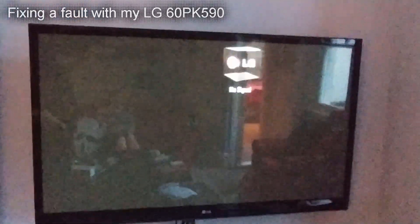I've got an LG TV and it's just rotating on this no signal. I've got a PlayStation 4, a PlayStation 3, and various other components attached to it. I did a big test last night, bypassing my amplifier, going straight into the TV, and it was still getting no joy in getting a picture. It is quite happy getting the picture from VGA and composite, but anything on the HDMI ports it's just not responsive at all and showing a no signal.